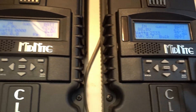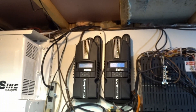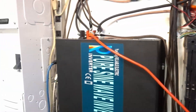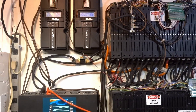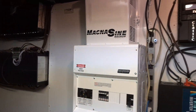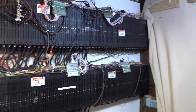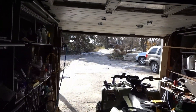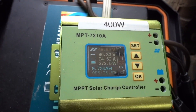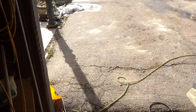I've only put 5.7 kilowatts in — nothing on the wind today. Just got my camera back up and running, so that's nice. I'll be able to watch everything and see it work. Batteries are doing alright, though they're kind of cold. I think my temperature sensor is inside but they've got to be close to zero, so I got the heater on in this room while I charge. I'm gonna turn it to high. I'm gonna try and be less abrupt when filming — had some comments about that. I have this baby charging as well; as you can see it's almost full. I have this only charge up to 61 volts.